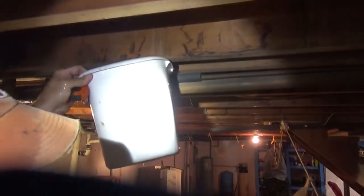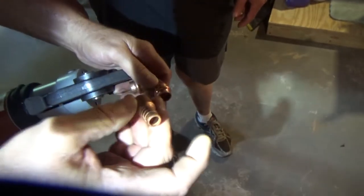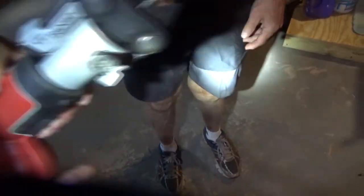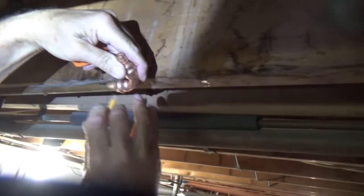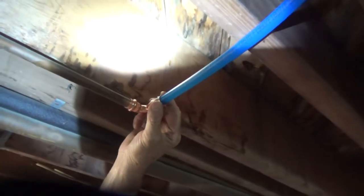There we go — let's just put fire. We have to clean it up with some sandpaper. It's a male fitting, and what I'm going to do is press it in a pro press fitting. There are multiple ways you could do them. I like to mark the depth on the fittings so you know you're inserted at the correct depth, because you could actually be out here. See, this is one of those fittings that fits on there right — see how tight it is? These are much better fittings. We'll put a clamp there and a clamp there. Just going to press it.